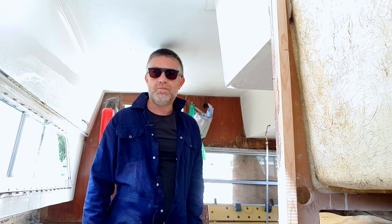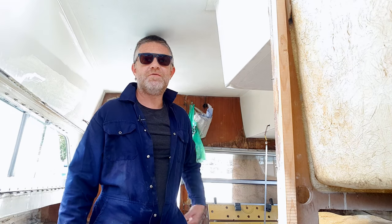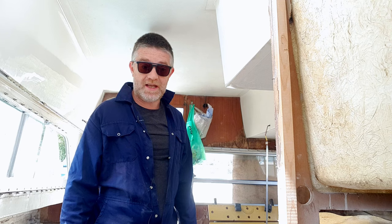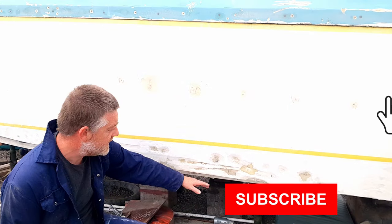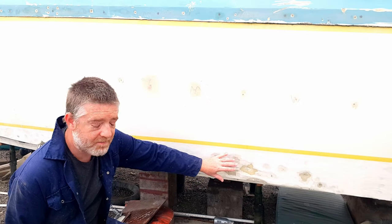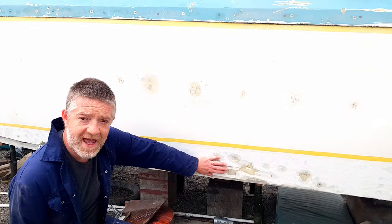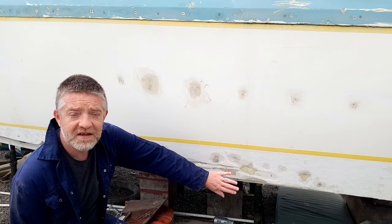Back for another instalment of great fun aboard Bebop. The wife is here. She's going to be grinding the starboard side below the waterline in preparation for me doing what I'm going to be doing on the port side below the waterline, which is making some gel coat based thick filling material to fill in the areas of bad gel coat that were ground out last year. We've done some cleaning and found stress fractures in the gel coat under the chime here, and also a little bit more osmosis in some sections, so I've washed that out, ground and sanded it back. The areas I've marked need fibreglass patching — we'll wet the areas, then get a layer of structured glass, then a layer of chop sheet, then another layer of structured, then another layer of chop sheet.